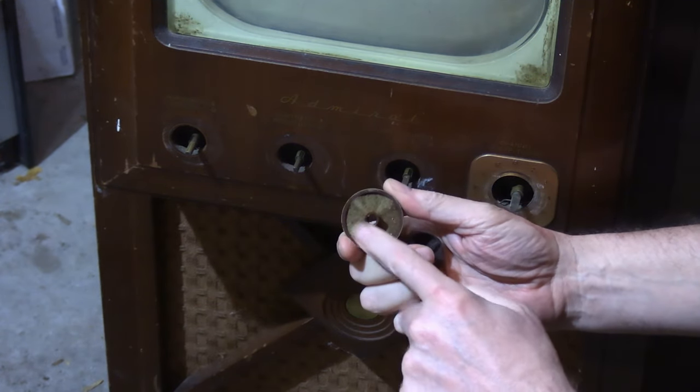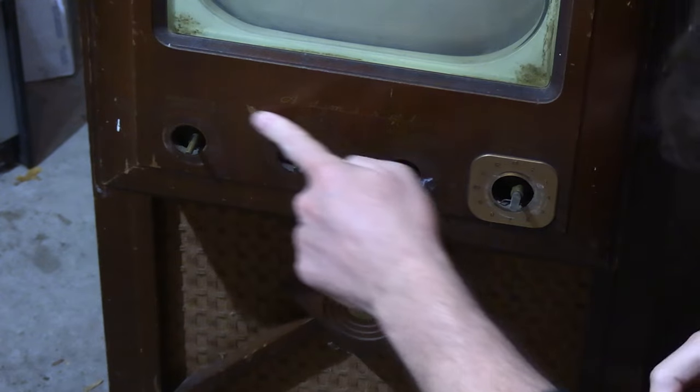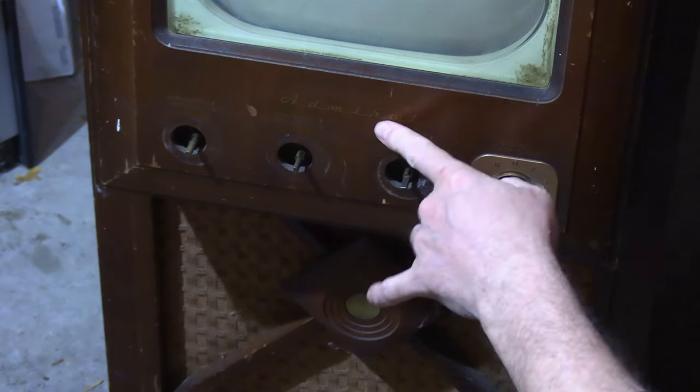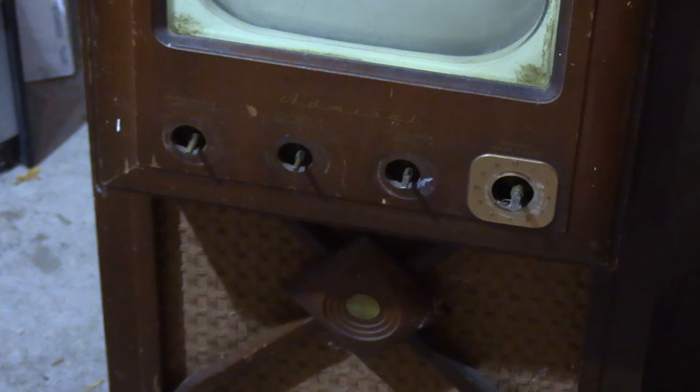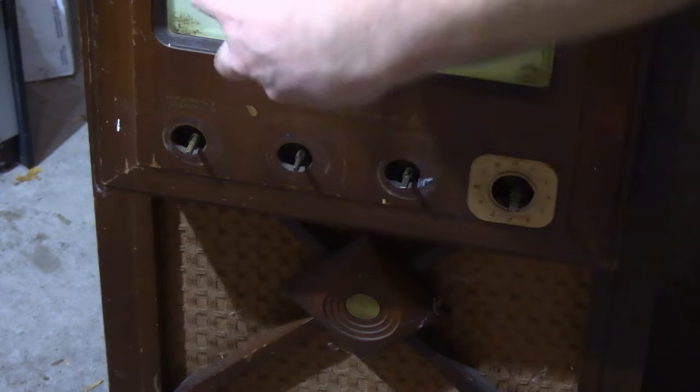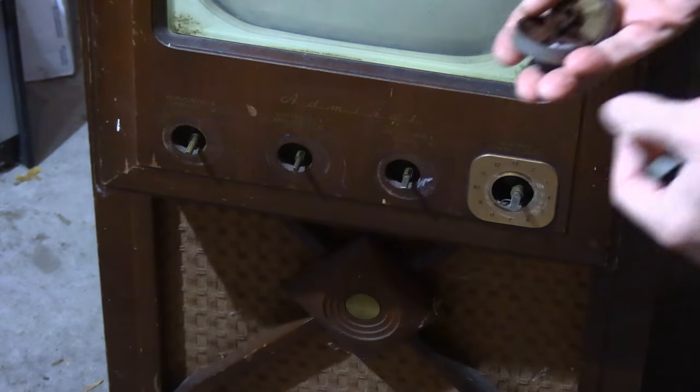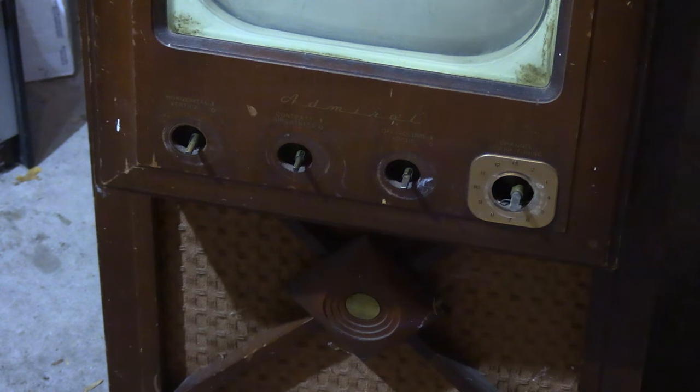Originally they all had felt behind them. Put all your knobs safely to the side and try not to drop them. The brass shafts and plastic knobs don't corrode or seize up — I've never had any trouble getting these off other than the outer metal jacket coming off. The channel knob often has a tail on it that people can snap off by cranking, but these sets are common enough that it's not hard to get replacement knobs.